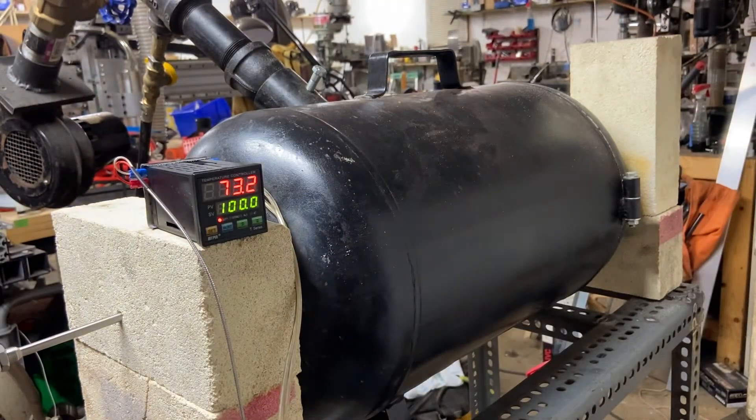That's pretty much it — do that and you'll have a very cheap and effective temperature monitor or thermometer for the inside of your forge. You could also use this in any other number of applications: monitoring your quench oil and quench tank, or if you've got a tempering oven it'll give you a very reasonable reading — much more accurate than the typically built-in temperature controls or dials on those cheaper ovens.